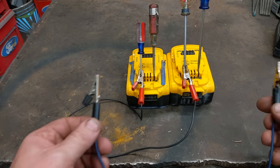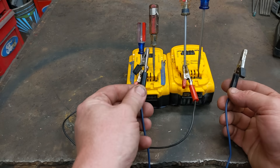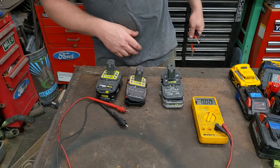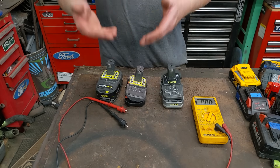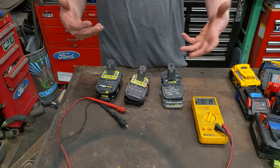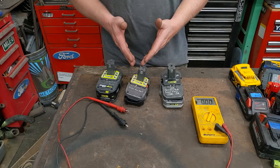People use paper clips and other sketchy things, but just positive to positive, negative to negative — jumper it for maybe 20 to 30 seconds. If the voltage is too low, that can bring it up enough to put it on the charger and see if it'll charge. Honestly, I think it's kind of a band-aid — the battery ends up failing in the future anyway because generally just one cell in there is bad.